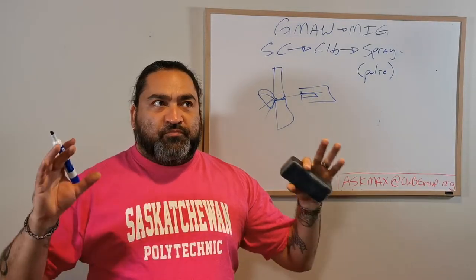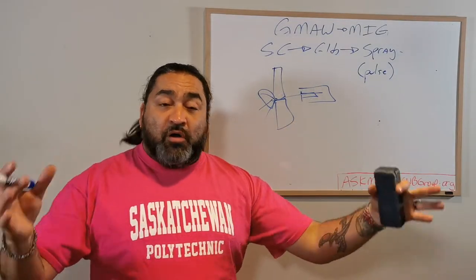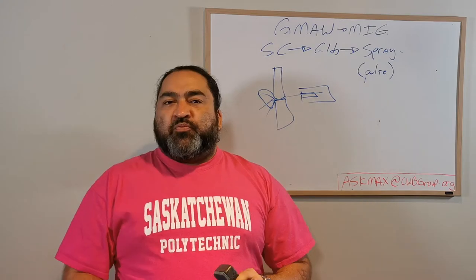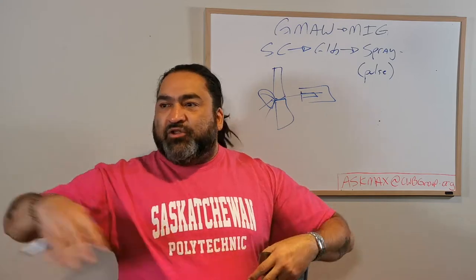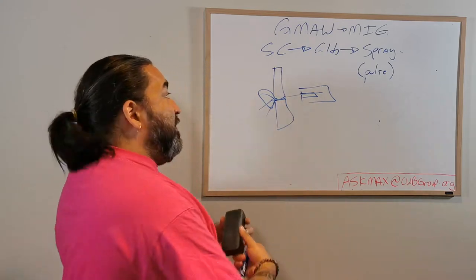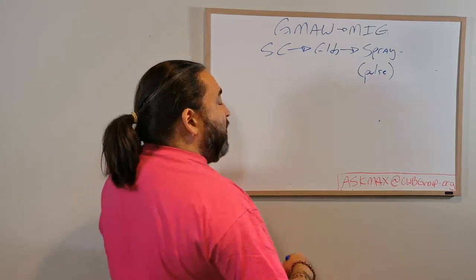Most industrial places, weldments, all run in spray. Why? Faster deposition rate, more work, faster, cleaner, less cleaning, get it out the door, make some money. I'm down with that. I like that. I like making money, right?